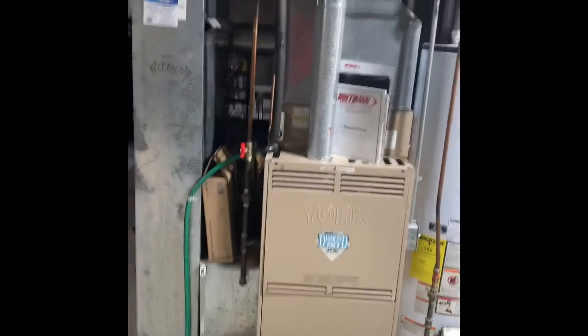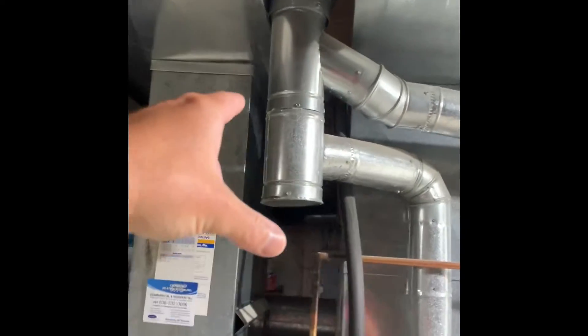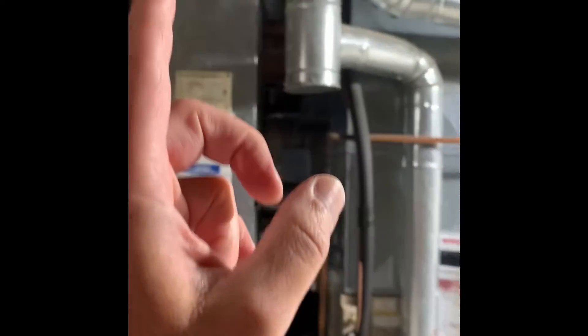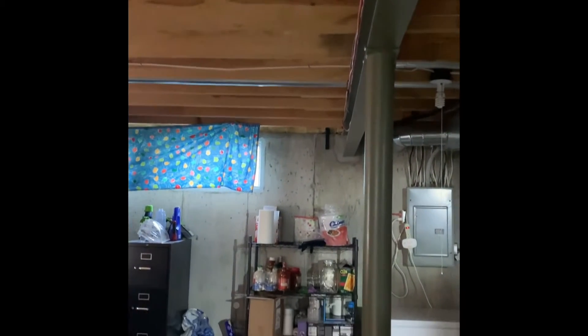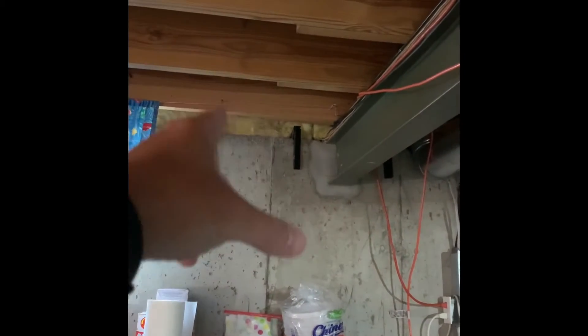Here's our setup down here. We're going to need a cap in the bottom — a five-inch cap. We'll PVC vent the furnace with two PVC pipes out. We'll take it through here, come out on the other side, come this way to the side of the beam, then run along this side of the beam and stay up above beam height to go outside. That way we get away from the dryer vent right there and the kitchen exhaust right there, so we get our distance from everything. We'll end up somewhere right in that range.